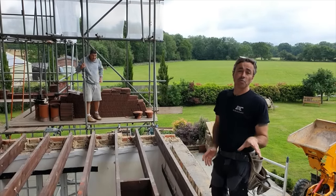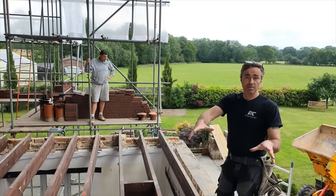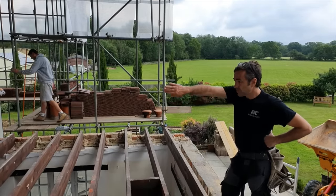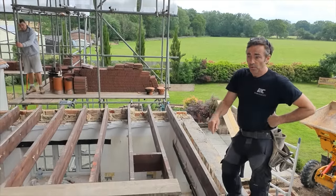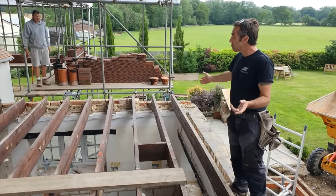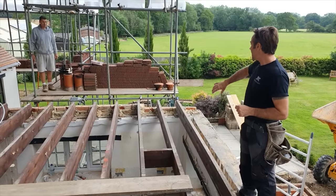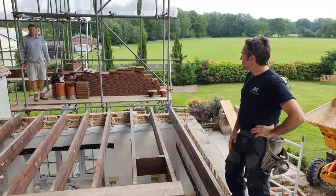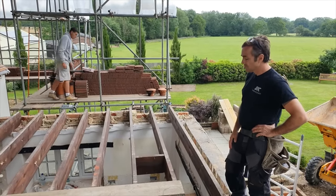We're leaving half the floor because we've got a room there which has got some stuffing we want to make sure we protect. So I'm going to cut the joists off in situ over where the wall is and then we'll just take them out. They're unfixed, so it's a matter of me just cutting them and Andy will just feed them out over the other side. So I'll get into position, mate, and then we'll cut the first one out.